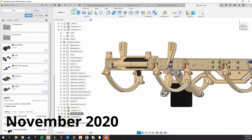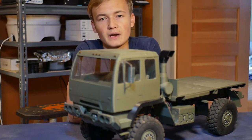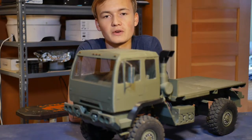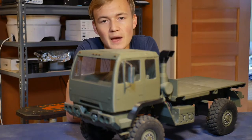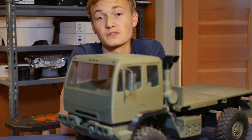As for suspension, I started with 3D printed leaf springs. I tried several designs — making them wider, adding more leafs, and so on. But I eventually settled on the fact that it's actually not that hard to make metal leaf springs. So I grabbed some tin roofing, cut it up with a pair of shears, and made perfect leaf springs first try. That being said, I do want to get some spring steel on these at some point in the future, so stay tuned for that.